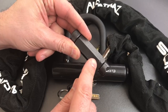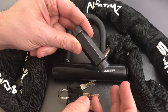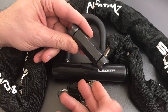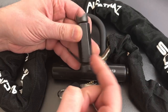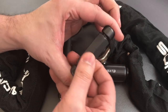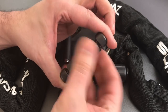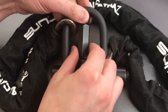This is actually an automotive tool designed for bending large cast iron exhaust manifolds that have been warped due to constant heat cycling. It's a relatively simple tool with two bolts — one has a standard pitch thread, the other is reverse — and what that means is that when you turn the center section, the two bolts will expand apart. What we're going to do is put that right underneath the shackle of this Mini U-Lock.